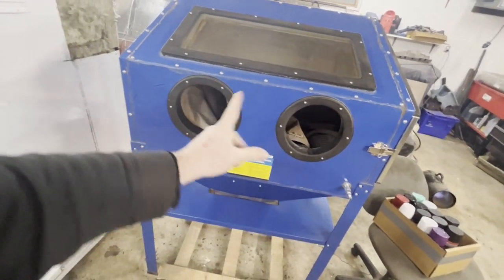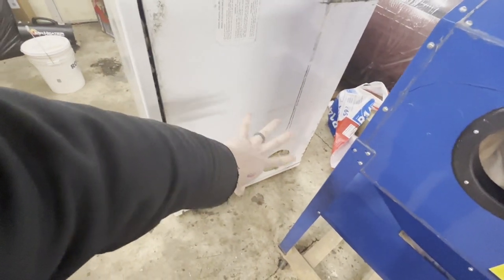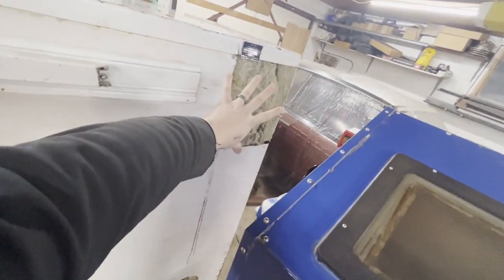I've got to cut away a little bit of insulation here and get our tube in. I need to cut a hole in the back to allow me to bolt in my heat sensor - the thermocouple - and I might cut some tin just to cover that up, but it's not necessary at this point. Might put a handle on it. Getting close - then we can start playing with the Mr. Heater to fuel this thing. I might save that for another video. Put the tube in and the latches on - we can kind of call the shell done.